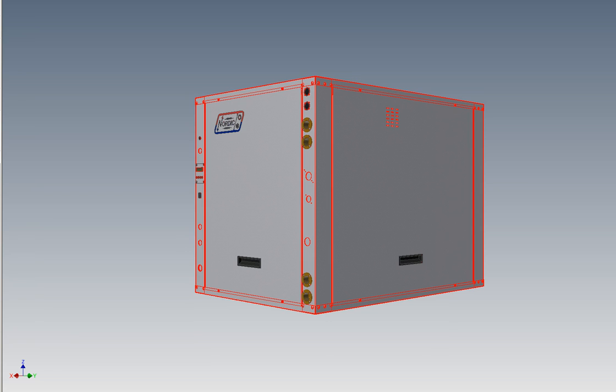The WH series, this new series I'm introducing, instead of standard R410A refrigerant, uses R134A refrigerant, just like in your car air conditioner. This has the effect of shifting the range of both the source and sink temperatures up. You need a source temperature of between 50 and 90 degrees Fahrenheit (10 to 32 degrees Celsius). This could be process or grey water, the buffer tank of an existing geothermal heating system, or an open loop water well in warmer climates. On the indoor side, you can achieve water temperatures of 160 degrees Fahrenheit, much more comparable to a boiler for retrofits of hot water baseboard or cast iron radiator heating systems.